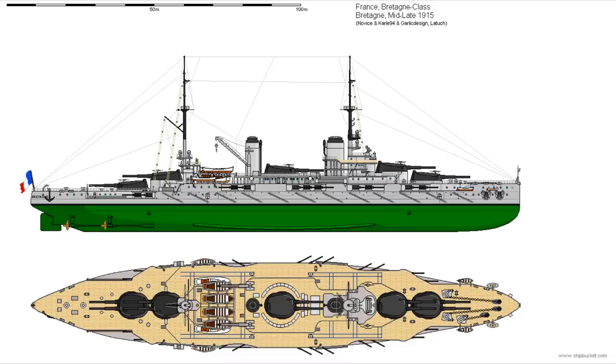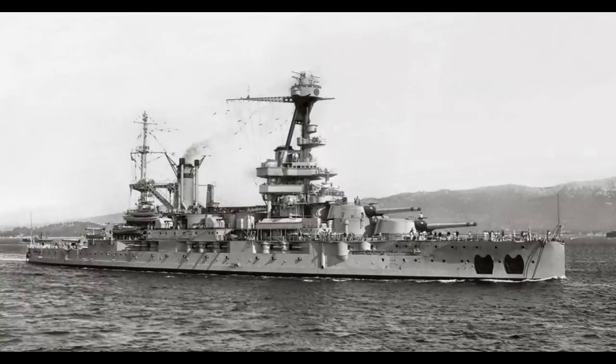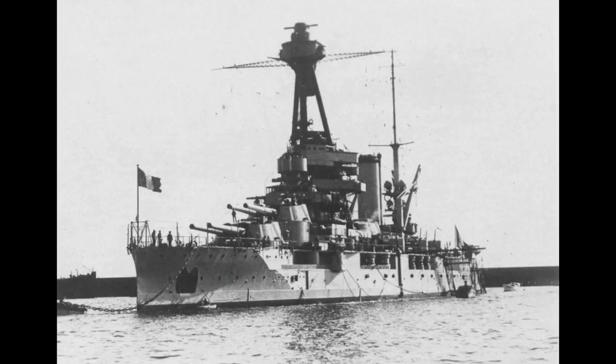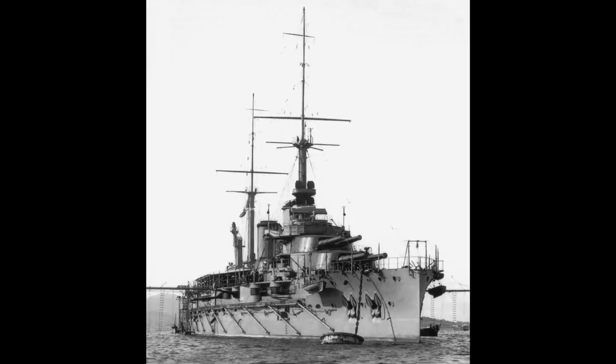As finances improved, all three came back into service and the French desire to tinker and customise re-emerged. Each ship received different numbers of oil-fired boilers to improve performance, as well as slightly different changes to their turbines. All of them got tripod masts, although always to slightly different layouts. Lorraine had her centre turret taken out in 1935 and replaced with an aircraft catapult and hangar. They also received different anti-aircraft fits in stages, with a variety of 8mm machine guns, 13.2mm heavy machine guns, 20mm, 40mm, and 75mm cannon, and 3.9-inch anti-aircraft guns, in exchange for varying numbers of 5.5-inch secondary guns being removed. By the outbreak of the Second World War, they were each almost custom-made battleships.